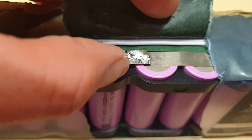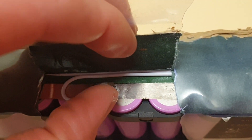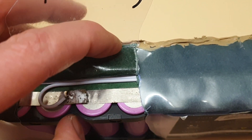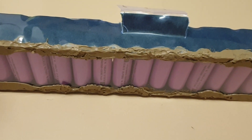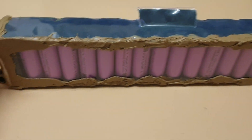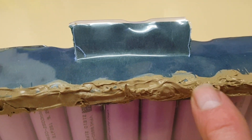As you can see, there was this crack — you see this cut. In my opinion this is the most common fault that's going to happen with your battery. In this case it's a cut between two batteries and you can see this plastic here is thinner. The battery is fitted here with four screws — some bad scooters only have two. It's best to disassemble a new scooter straight away and do maintenance. As you can see there was silicone here and it was nicely attached, but in the middle it's actually come apart.